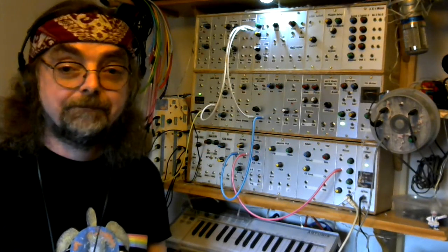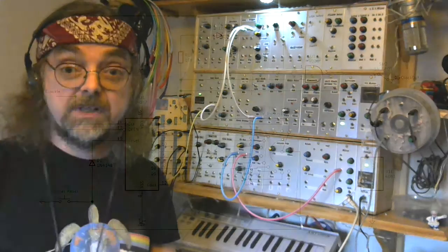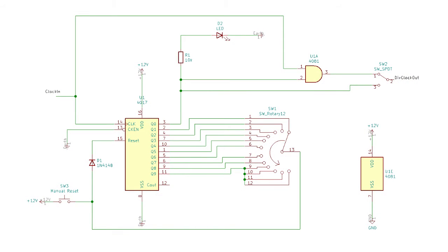There's the theory. If you want to know what the circuit diagram looks like, it's this. It's very simple — we've got the 4017 chip as before, and then on my version I've put a switch in so I can switch the AND gate in or out. We're simply using one of the AND gates on the 4081, and then the output from the AND gate is the synchronised output — matching the trigger or clock signal going in with what's coming out of the 4017.